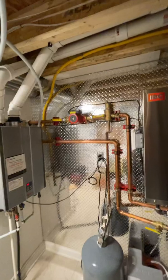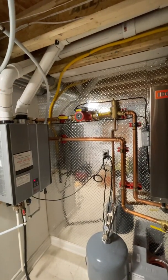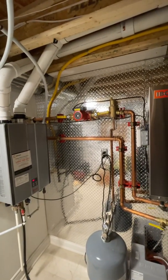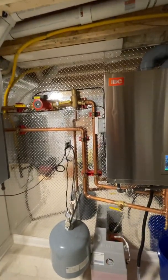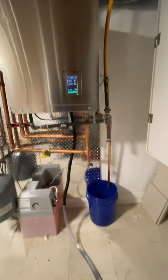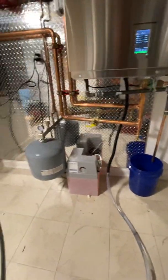What's unique about this system is there is only one circulator pump. It's a single call, single zone system, so there is no need for a boiler loop. That makes things a whole lot simpler and of course more affordable for the homeowner.